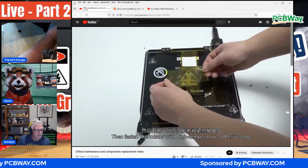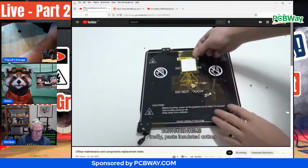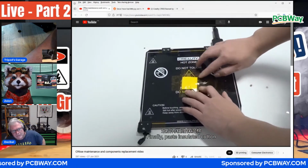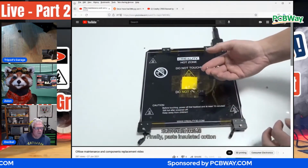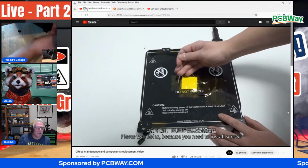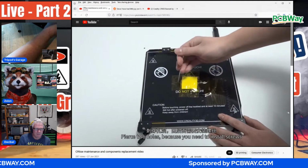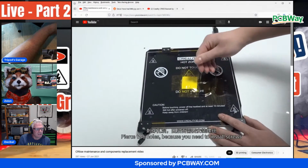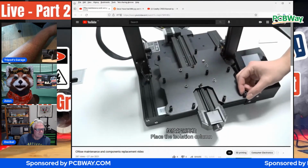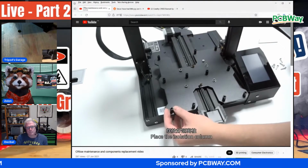They're actually doing two pieces of Kapton tape. The reason being there's no screw now, to remove that completely, that option's gone. So no screw, which is why you have to remove the bed: you're making doubly sure there is no risk of any shorting in case you find it's not your clamps, it's your thermistor grounding out. They took it a step further just to be sure.